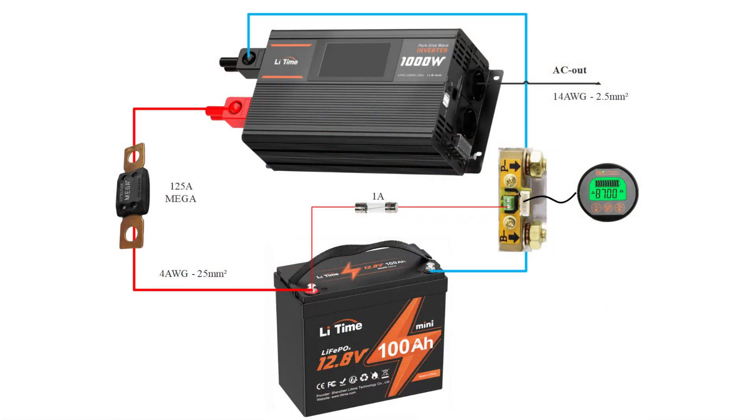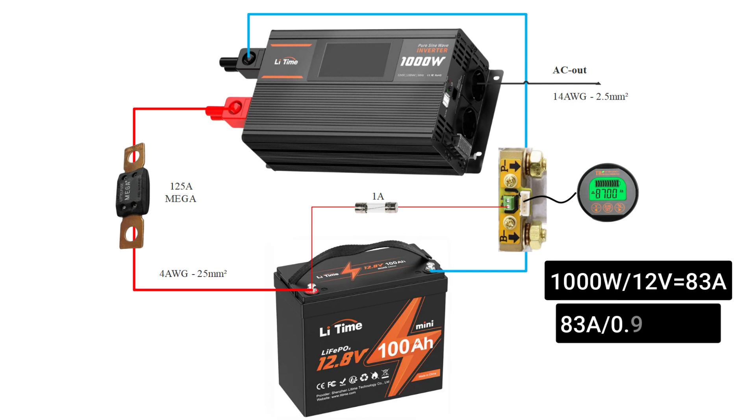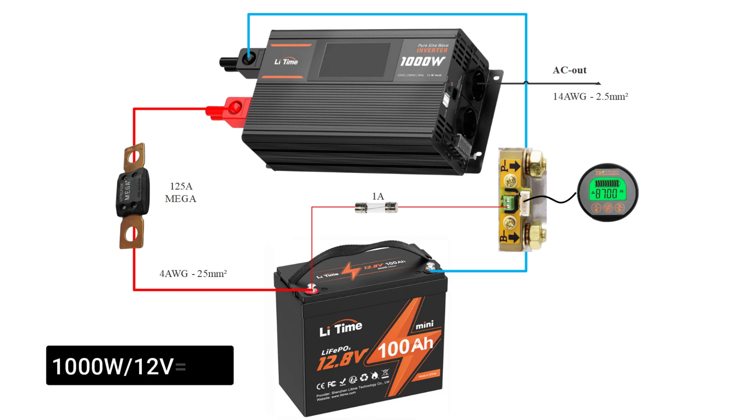Here's a schematic detailing the wire and fuse sizes for this inverter. We calculate the current as 1000 watts divided by 12 volts, giving us 83 amps. Dividing by an efficiency of 90%, we get 92.5 amps, and multiplying by a 1.25 safety factor, we get 115 amps. A 4 gauge or 25 mm square wire rated at 105 degrees insulation temperature is suitable — this is welding cable and it can carry 150 amps. The fuse should be between 115 and 150 amps, so a 125 amp mega fuse is perfect. I'll put links to all these components in the description. This 100 amp hour lithium battery can run the inverter, because we are just below the 100 amp limit of the BMS.